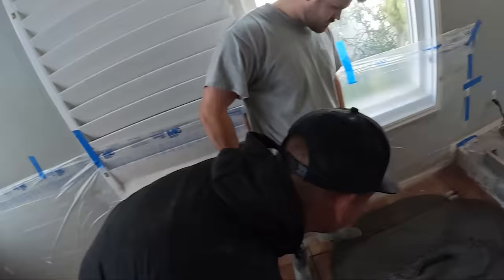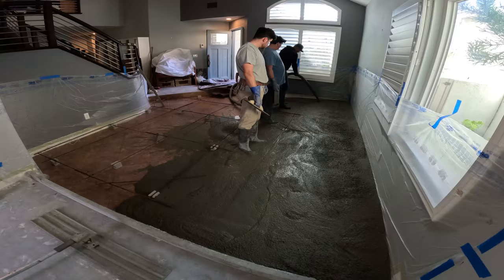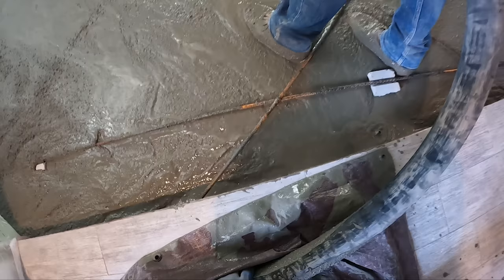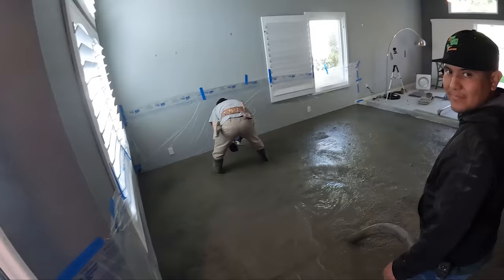Pull the bead off of this wall and then all the way off of that wall. Now we're getting to the concrete part. This is a special mix design so you still get the same PSI but it's a flowable mix, so we don't really have to screed this — we're going to screed it, but we really don't have to.